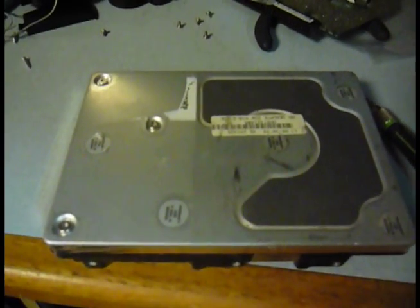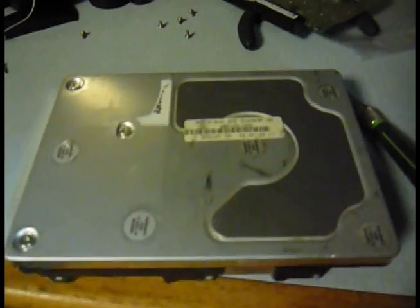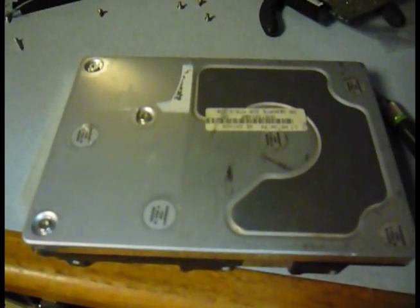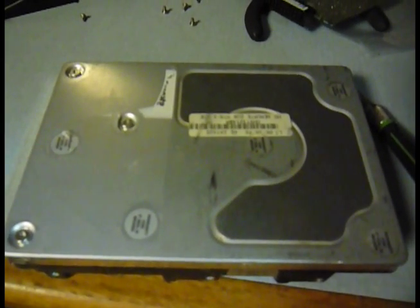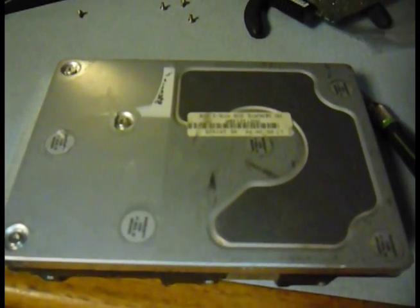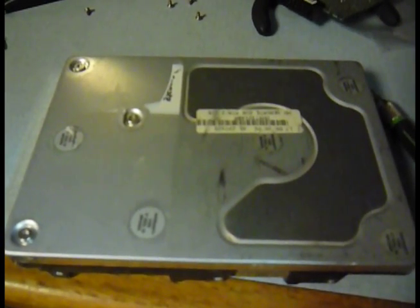I'm starting here with an old three and a half inch hard drive — a two gig drive. What I'm going to do is take the platters out because, believe it or not, if they are made out of aluminum, not glass, you can cut them into a circular shape and use those as a mirror for a laser cutter. The optical qualities are similar to the expensive mirrors you'd purchase otherwise — about 80 to 90% optical quality compared to professional mirrors. It's not exactly the same, but it's darn close.